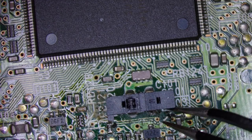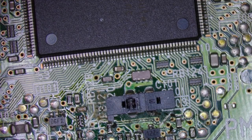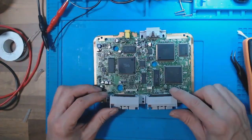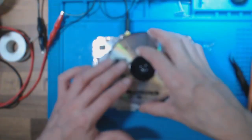First thing I'm going to do is look around here - I'm going to clean that switch up, put some IPA in there. If I press the switch down I can hear it, so I know that switch is working. I've cleaned that switch, I know that switch works. There's no movement in the CD at all.